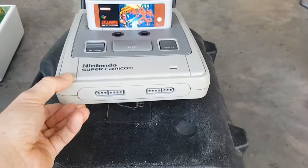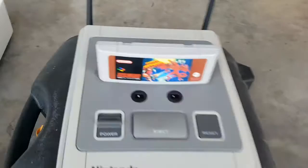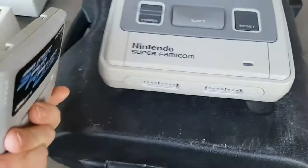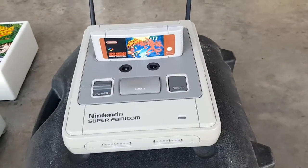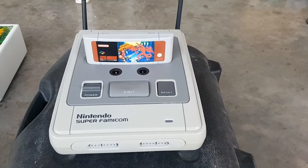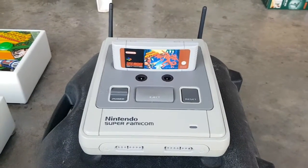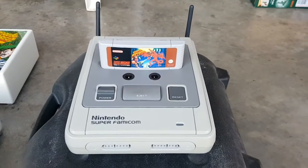What I wanted to show as well is the restored colouring on the Super Famicom. The Famicom plus the cartridges were probably this colour — as you can see the bottom half of the cartridge is yellowing, which is pretty common. The top cartridge is restored, which is basically the same colour as the SNES. I've done a lot of research into it. I know people who try the Retrobrite method, which creates a paste using peroxide paste or hair bleach — but I think that is a really bad way of doing things, mainly because it's inconsistent, and it can end up giving you blotchy results.